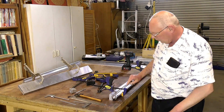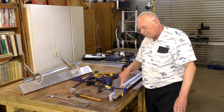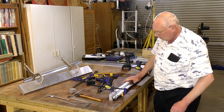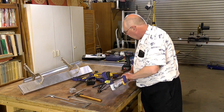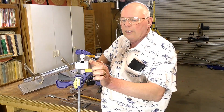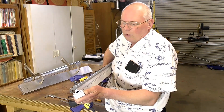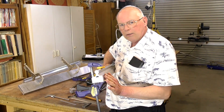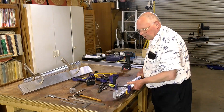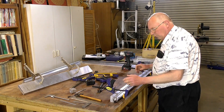This is the linear guide rail and the main chassis support. What I've done is laid both of them down flat on my bench, because what I wanted to achieve was to have that flat edge all the way down. It's slightly off to one side but that's okay — what I'm after is a parallel attachment to this chassis member. All I've done is laid it on the bench and clamped it with some Irwin clamps.